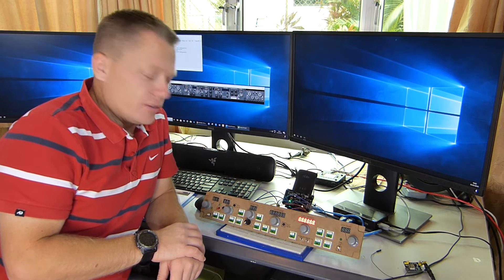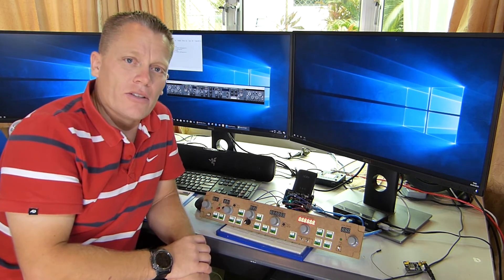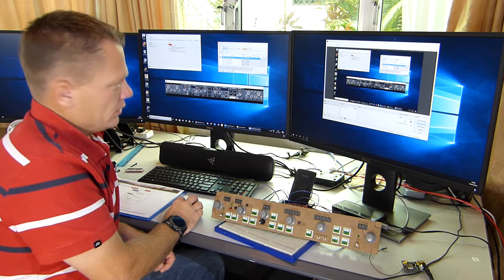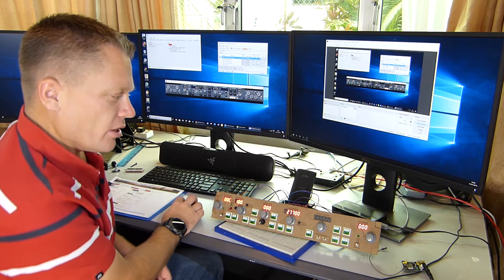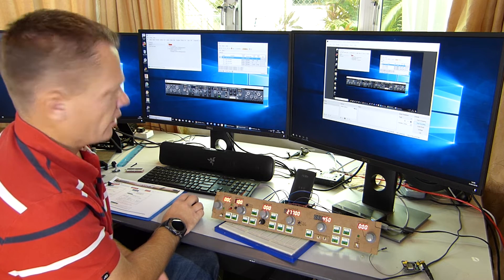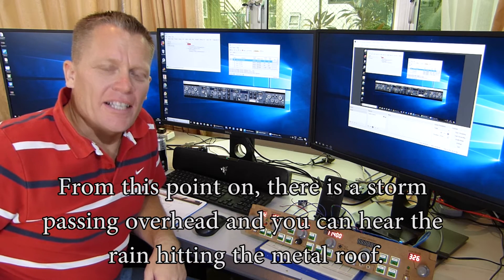Let's switch MobiFlight on, tell it we've got two Arduinos connected now and what's connected to those pins. Hopefully the seven segments should set up the way we left them on the last episode. I'm going to hit run on MobiFlight — and there we have it. Everything seems to be working. So that's what I left you with in the last episode. Let's get straight into the encoders.